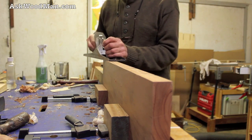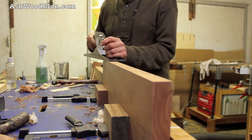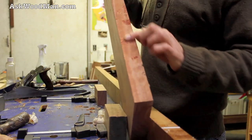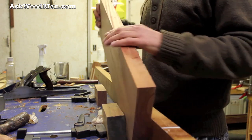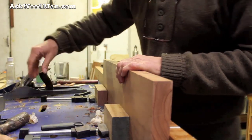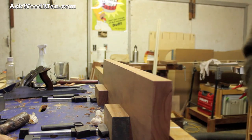Let me back this blade off a little bit to make sure I'm not going to try to take too much. I think you can see here right off the bat, before I lock this down, there's some finish residue on here that we're going to cut off. I think you'll get a picture of the nice cut that this hand plane can make, even in what I believe is the hardest wood I've ever encountered.